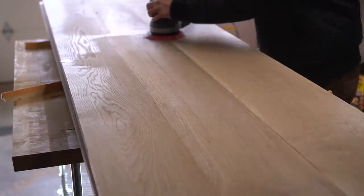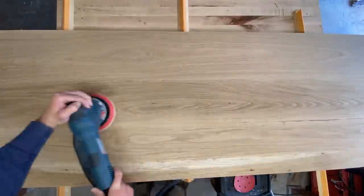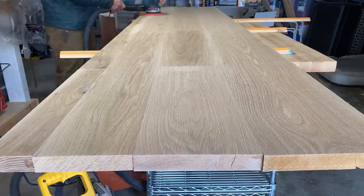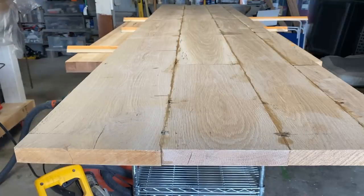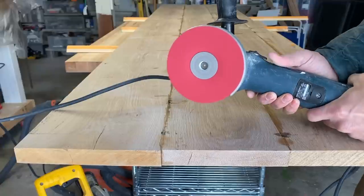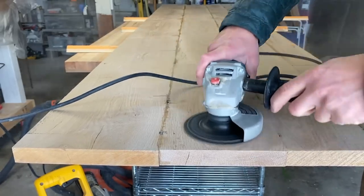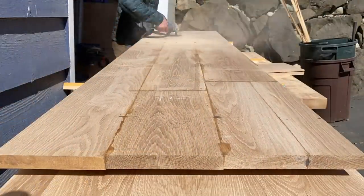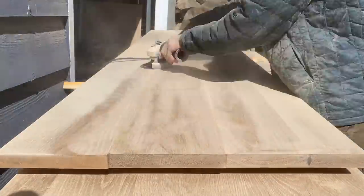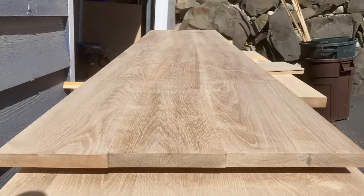The sanding portion is extremely vital to the outcome of the project because it really gives you the overall feel and depth you want. Take your time and due diligence on the entire slab. For the bottom section, to increase productivity I suggest using a grinder with 60 to 100 grit sandpaper — it's quicker and you don't have to worry about swirl marks on the underside. Also set aside some fine sawdust because we'll use that mixed with glue to fill holes on the top surface — that's the best hole filler.